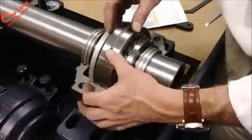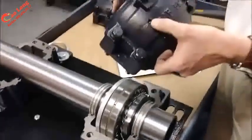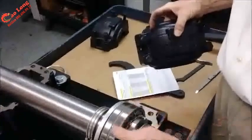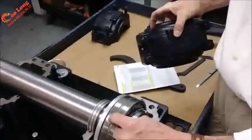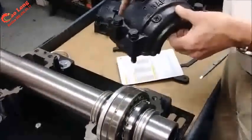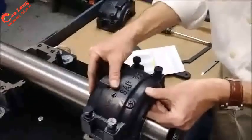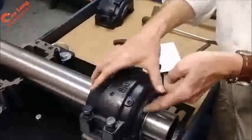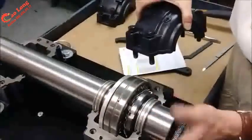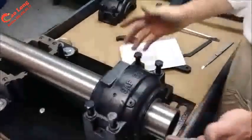So during relubrication, there is a fitting, a plug provided in the housing, and this matches up to the lube groove that's in the bearing. So grease would come from the center of the bearing, internal, and then spread both ways as the relubrication process takes place. I think during assembly at the end, as we put the cap on, it would certainly be wise to pack the seals full of grease so you give every possibility to make sure that it's fully lubricated.